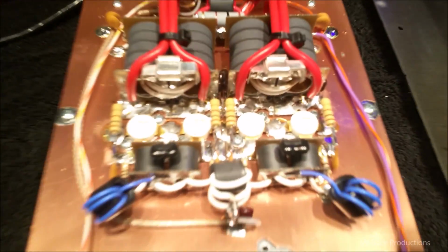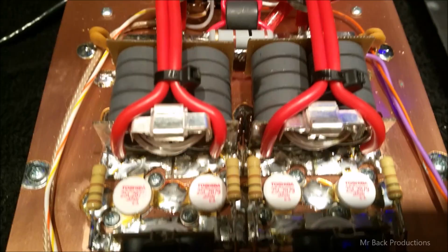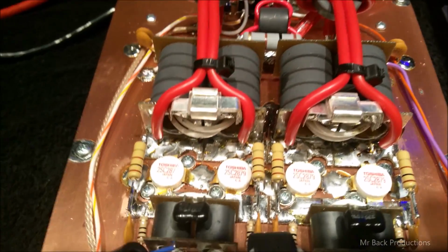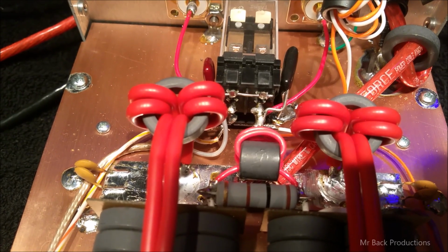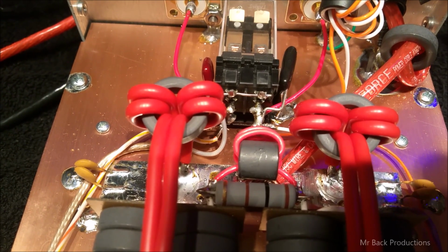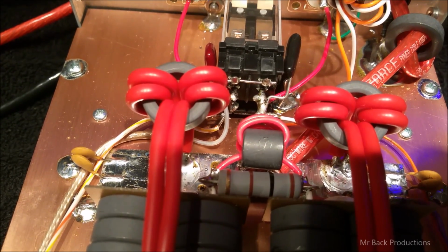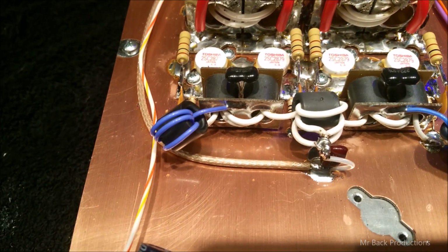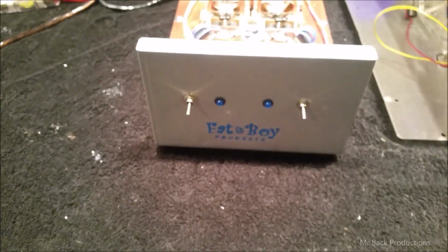Dennis, we did all of that and some more. So Dennis, that's a matched set of Toshiba 2879 non-red dots. We upgraded your power wire. We changed your output combiner. We went to a 2-to-1 instead of a 1-to-1. Changed your output tune, went from 150 to 140. Changed your input tune and brought it down to 230, which brought it down to less than a watt. And let's see, what was the other thing we did?